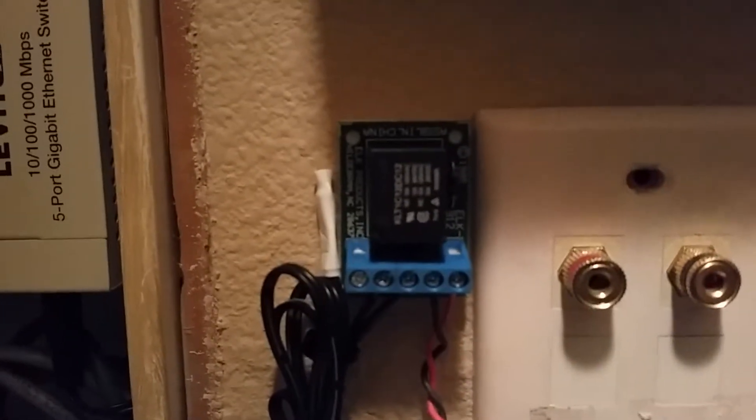The Web Relay has a stay-alive, keep-alive, or watchdog feature. Every 30 seconds it pings one of Google's DNS servers and waits for a reply. If it does not get a reply, it shortens the ping interval and pings for an additional set number of times. If all those attempts get no response, it throws its relay for a predetermined few seconds, which then energizes another relay that loops power through the DSL modem.